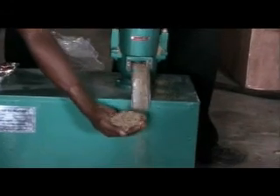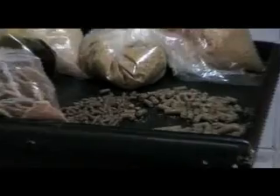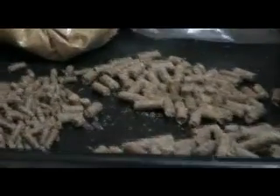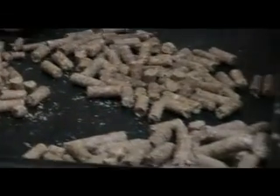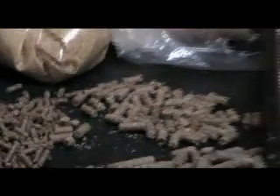All our pelletizers are capable of producing various sizes of pellets — from 2mm for juveniles, to 4mm for post-juveniles, to 5mm or 6mm, and then 8mm. These various sizes relate to the age, size, and growth of your fish. Formulation varies accordingly, and the system is ready to produce to your taste and deliver good quality feed.